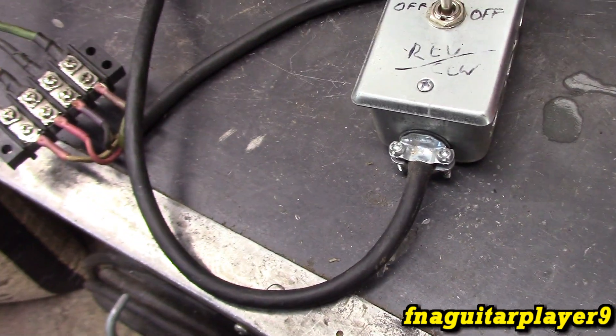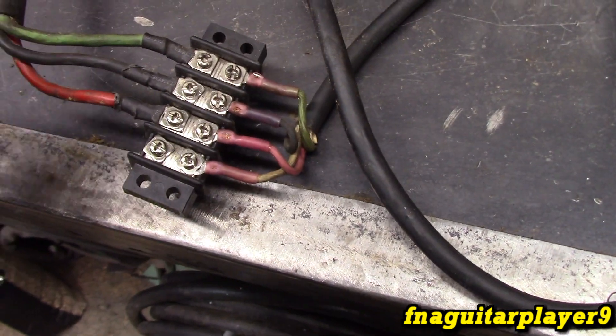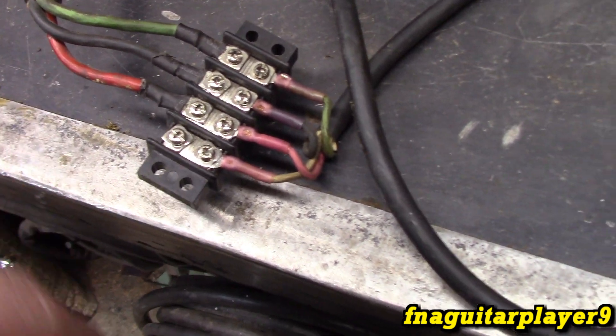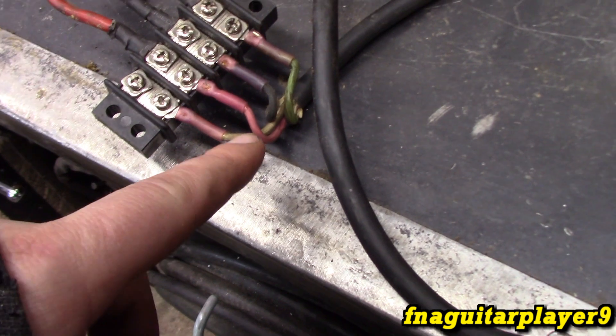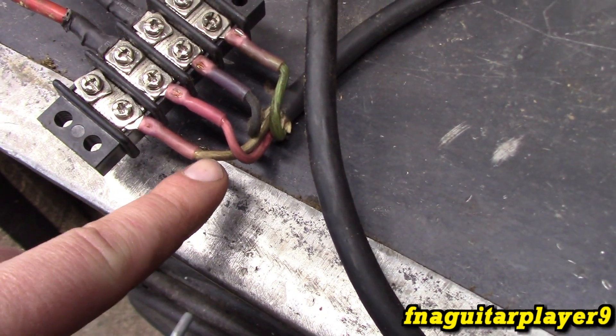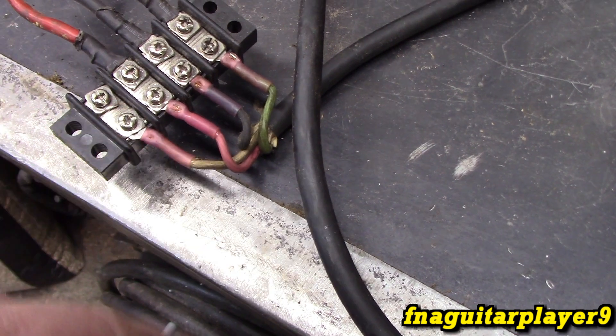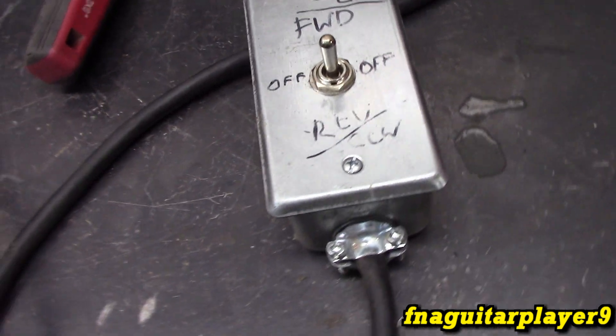If you did use a bigger motor you'd have to have a bigger capacitor. So what's going on here — this is hot at the moment — we have 240 volts coming straight from the breaker box on a 30 amp circuit. That's two of the three legs hooked to the three phase motor. The third leg is the white wire, and the green is just a ground. Black and red are two of the phases and white is the third phase. This is a reversal box here.